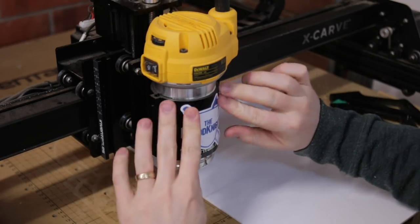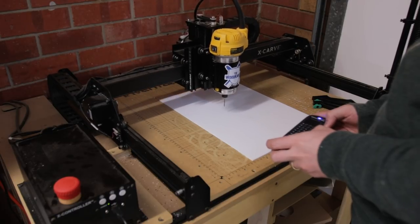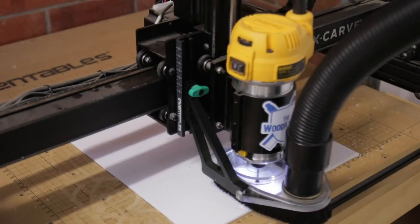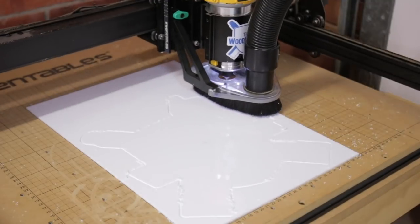For attempt number two, the proper safety precautions were taken, such as sticking my logo on the spindle for good luck. Even though I'm getting good chips from the acrylic, it has staticky properties that make dust extraction not seem to work all that amazing. Compressed air, or in this case my shop blower, help with chip clearance.